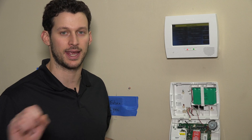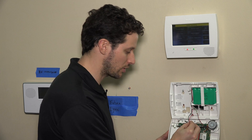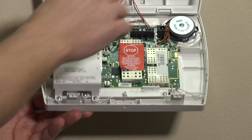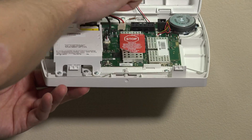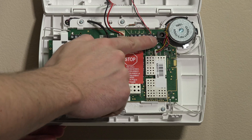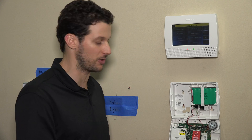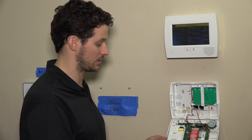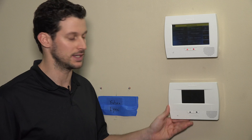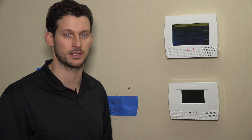When powering back up the panel, it's very important to put DC power on first, then AC. The DC power will be your backup battery. There's a clip that runs directly to the board — it's the larger of the two tan clips. Snap that into place, making sure it has room to open and close without getting pinched as you close the unit. If you're using the LT cable, plug it into the DC port on the panel just to the bottom left of the speaker. If you're custom cabled, we always recommend powering up at the transformer. Keep in mind, when you put in the DC battery power it will not power up the system — the system will not power up until you apply AC. If you lose AC power in the future, the DC power will pick it up and continue to power the system, but it will not power the system without AC power to start with.